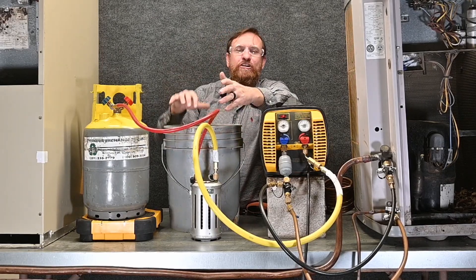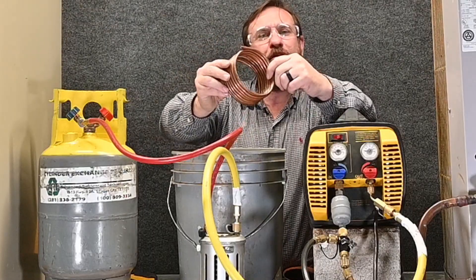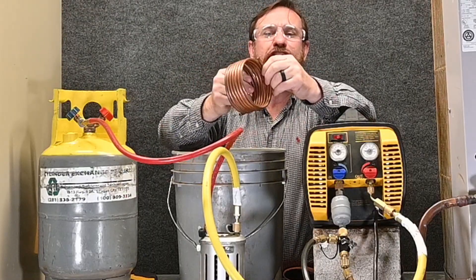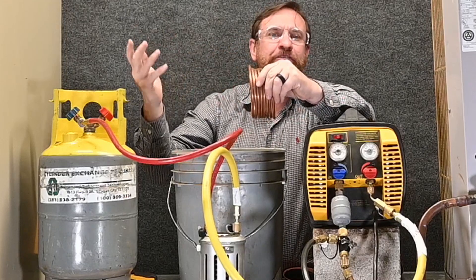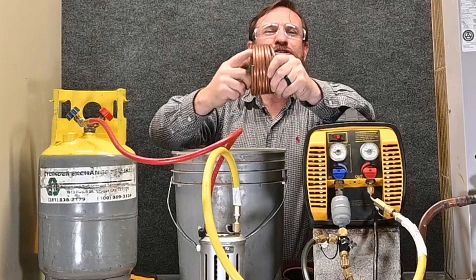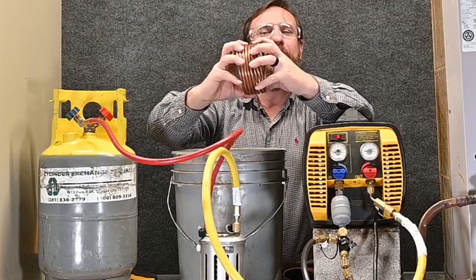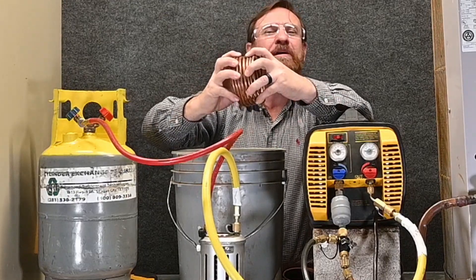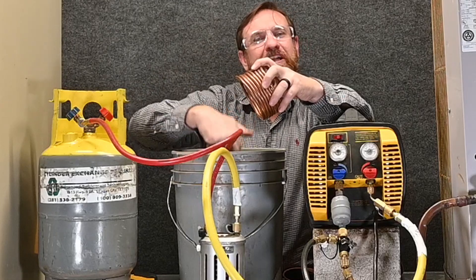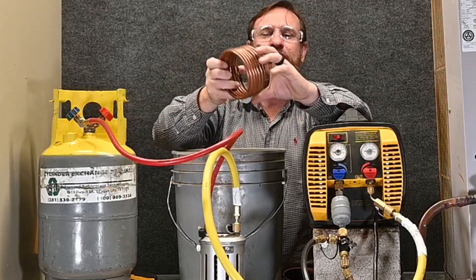A company sells this device and it's a great option, but not your only option — all it really is is quarter-inch tubing. I've taken some quarter-inch copper tubing from another ductless job, made a nice little coil, and you'd braze two or three of these together. You want to separate and spread them out so the metal isn't touching itself, giving more surface area for the cooler water to contact the copper and provide better heat transfer.